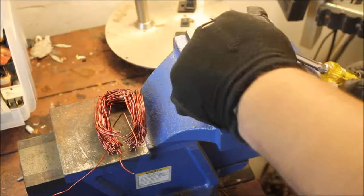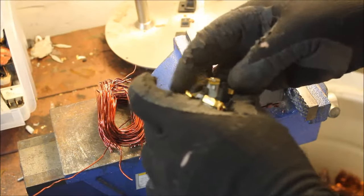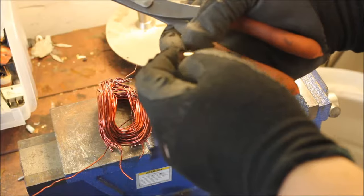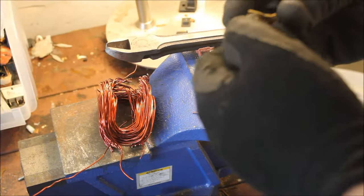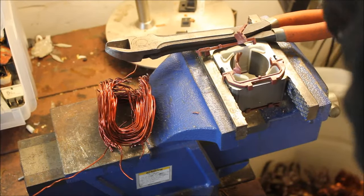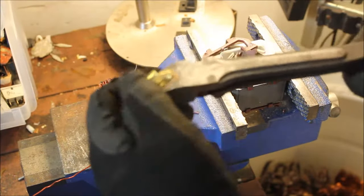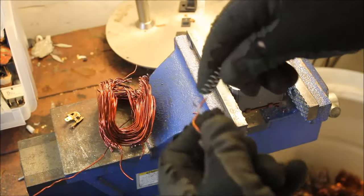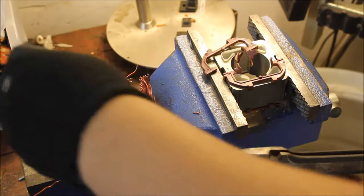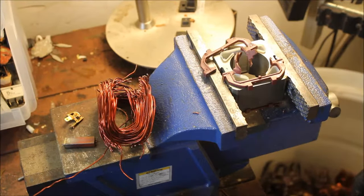On this side there's some more copper, and those pieces I took off the casing — there's going to be some brass there. Back to this piece, you just pull it out like that. Some people resell these; there are buyers who put them in old electric motors, but I'll just scrap the whole thing. Cut this little copper line here and that should free up your brass. You'll also have a little piece of carbon, more copper, more carbon, and the casing is going to be ferrous.